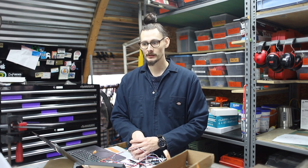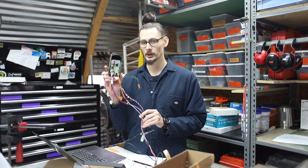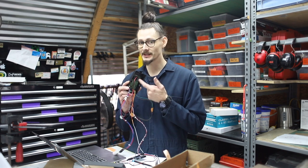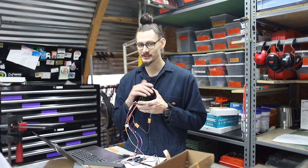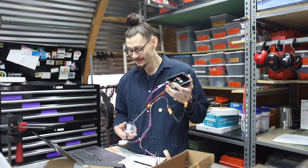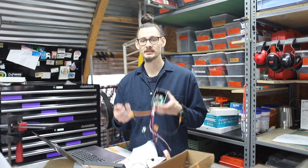On Wednesday nights, my brothers and I, we get together and we do some hacking. We try and figure out what the heck's going on here. Our current goal is actually to get the parking brake controller accessible via the CAN network. It's got a microcontroller on the inside. It does all the things that the parking brake system needs to. It's just not accessible via our fancy new buttons. And in theory, that shouldn't be too hard. All we really gotta do is sniff the inputs and outputs and fake them via controller. Let me show you this up close.